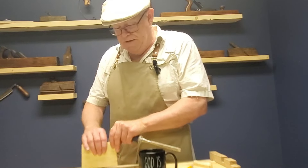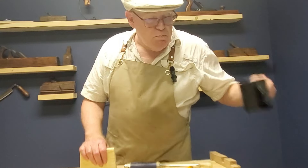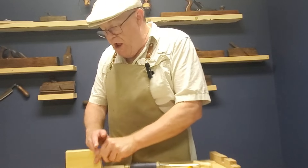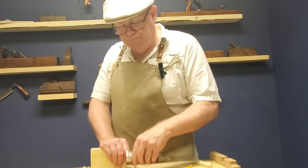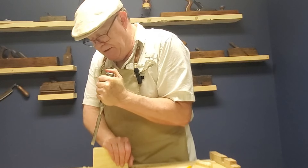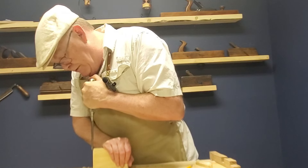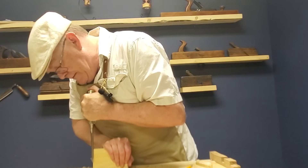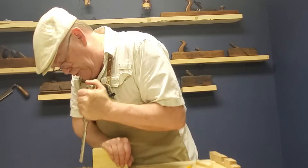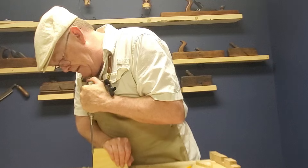The way he is doing this — let me clear off my bench here — he's holding the work with one hand, grasping the chisel by the handle with the other, arm tucked in. As we begin to cut, we lean into it and take a nice stroke. So you're using your body as leverage.